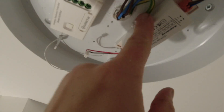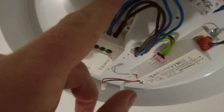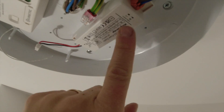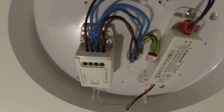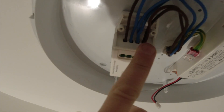This is an ideal connector - just a push-in two-way to keep continuity. I've doubled up the live and neutrals. If you had three here you wouldn't want to put three in these - you'd probably use some connectors and bring out single cables. I managed to get two in each, fits in there lovely. I'm going to get a piece of that old cable on the floor, strip a brown and a blue out of it, and come from the kinetic receiver into the light fitting. When you click the switch, it's going to switch this LED driver on. Live and neutral out of my live and neutral connections - the neutrals are commoned up on these, they're only switching the live. That is a commoned bar - I have tested that out before.